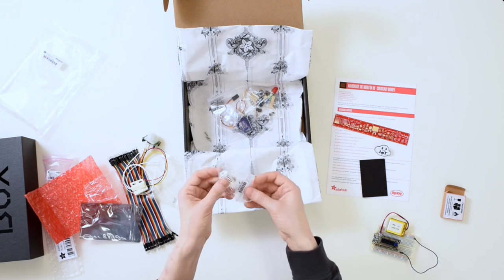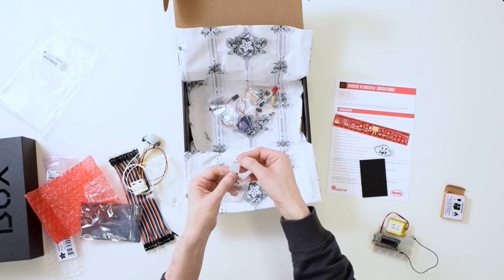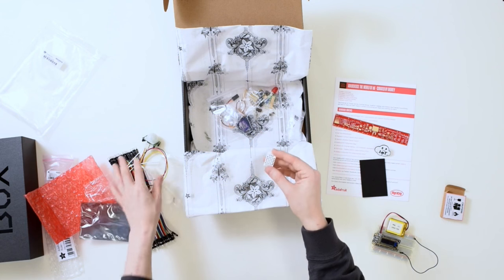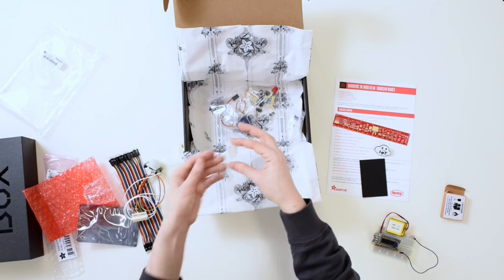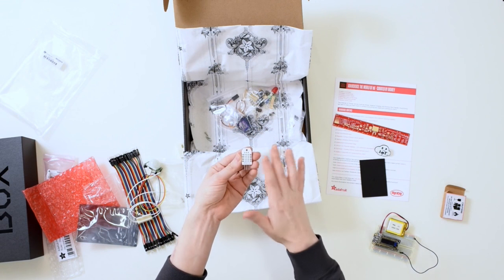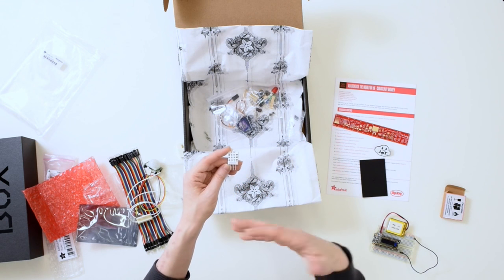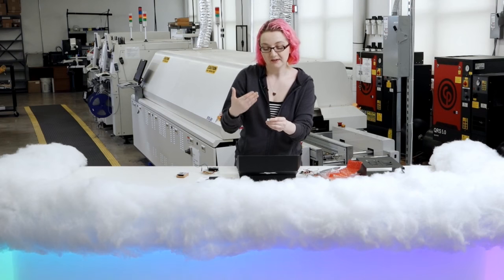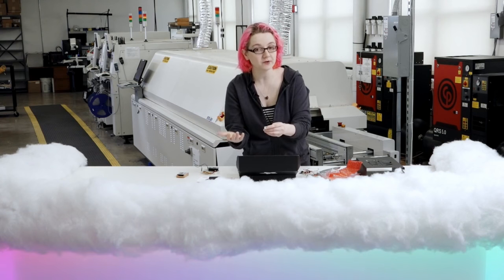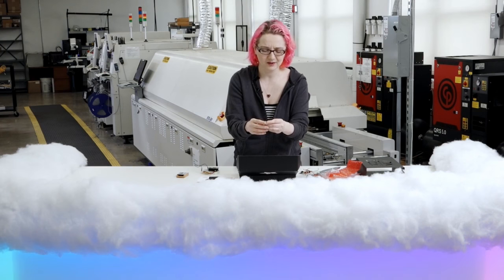Okay, now this is also a great sensor. This is a DHT22 temperature and humidity sensor. So I'll be showing off a demo with this soon. It's kind of nice. These other sensors sense motion or location. This does environmental sensing. So inside of here is a temperature sensor and a humidity sensor. So when you wire this up to your Feather, you can detect the temperature and humidity locally, and then maybe use Adafruit.io, send it to our service, and graph it over time. So you can detect when your greenhouse maybe needs a little bit more misting, or maybe your house is really too hot. Maybe turn on the AC or something.